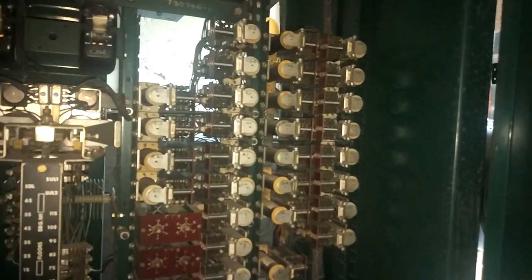Yeah, what's it like? Oh wow, some buttons. You're pressing CP. The relay lift logic seems to not be working, either as a relay fault or safety's not connected, which is probably the most likely reason, since the doors don't seem to be closing properly. So the only way to operate the lift is to press in the main contactors.